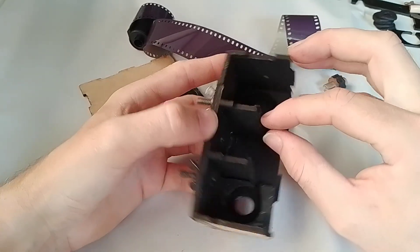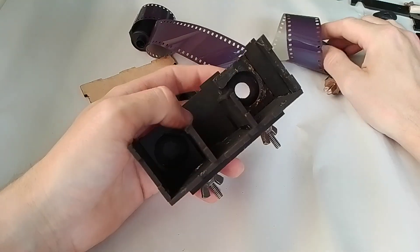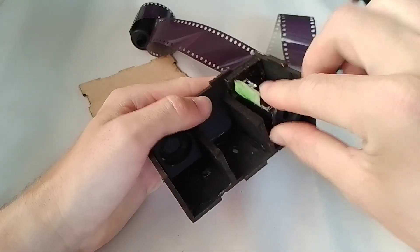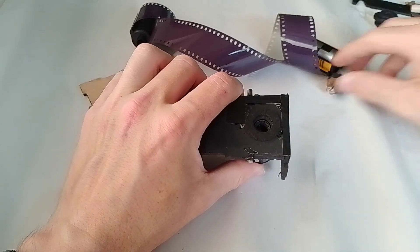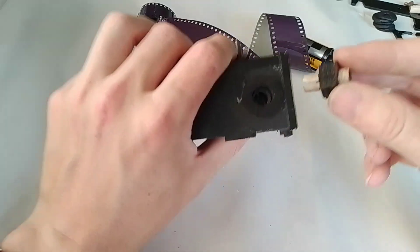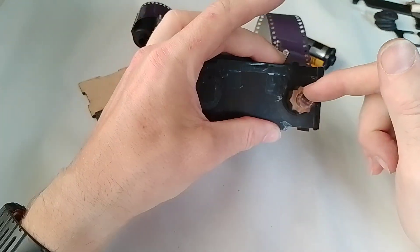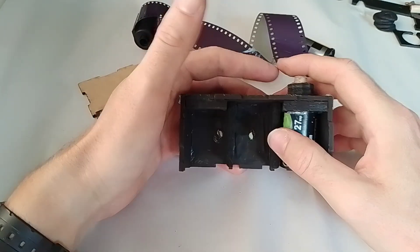We have two baffles here. I put felt on these, but ultimately it's not necessary, I found with testing, which does make it simpler. I rely on the mating of this line here, sort of lightproof against it, and then having another foam baffle. And then this is a little dowel with a little slot stuck in it — you can just use a big pen as well, that works quite nicely. And that sticks in there. Between the foam on the inside, the foam on the outside, and the friction fit of this baffle, which is quite good, it's lightproof and it takes photos and it's really cool.